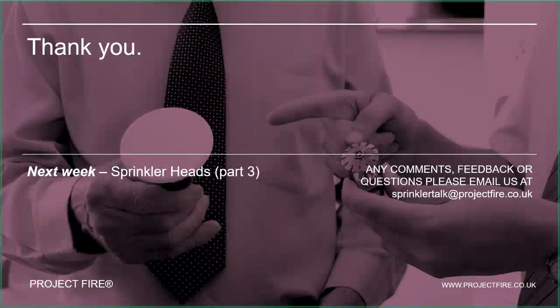I can see a couple of comments coming in, so I'll have a quick read of those. Yeah, good. So thank you. I got a comment here reminding me about the categories of water. So we need a non-return valve on the supply line to the sprinkler tank, which is quite right. We have the float valves, which are providing essentially a non-return valve into the tank, but we also need a non-return valve on that supply line as well. So that would be required.